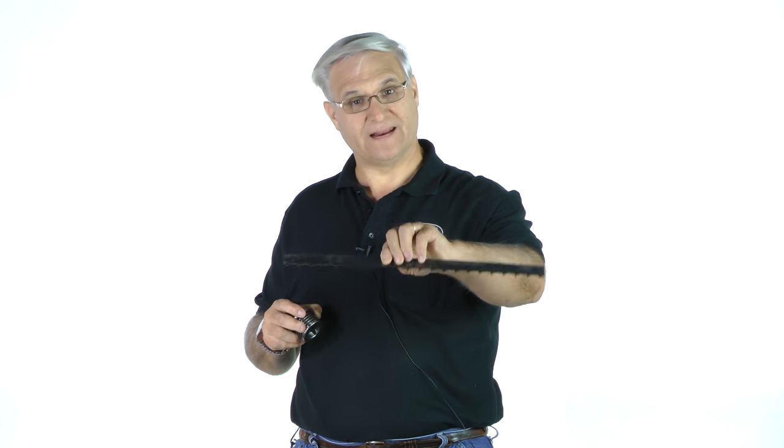In other words, if you're sawing along and the blade moves out of the direct straight cut, did it go down first or did it go up first? All these things help us put together in our mind so that we can help you figure out what's going on. Sometimes it can be the blade. Sometimes we ask, have you replaced your roller guides?